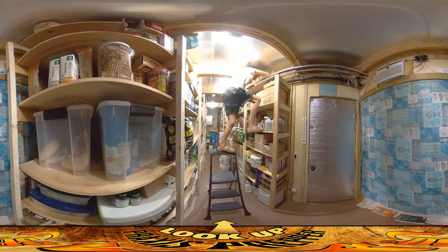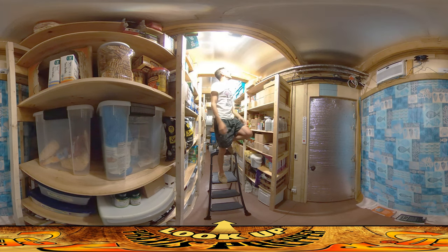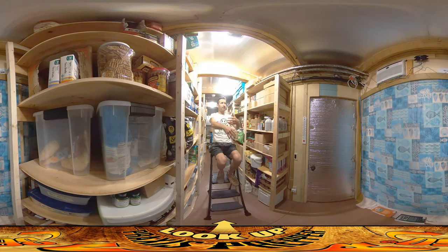The batts are 13 inches wide but the gap is barely nine inches, so I'm squishing them down. They're rated R13, but since they're compressed I figure I'll get a little better than that. I've got six bays to do and I've just done two. The other thing I need to do is make a hard door on the inside — even though I've got air membrane shower curtains in there, it still leaks into the hot room. I'll keep the cloths as draft blockers, but I really want to get this place as insulated as possible. Right now we're holding around 62 degrees and I'd love to bring it even lower. That's it, thanks for watching.